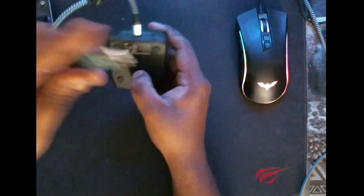And then in the meanwhile, you're going to plug this into your PC. This is the Zen — I'm going to flip it, keep pressing the reset button which is right here, press on it, and then enter this into the PC. It's going to say 'Zen bootloader' on the OLED screen.